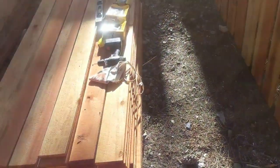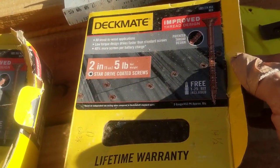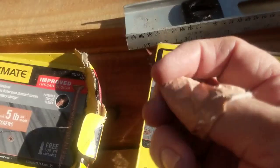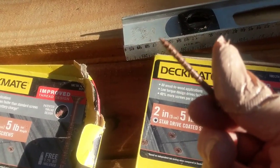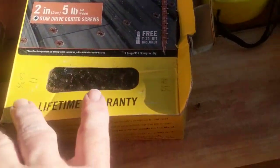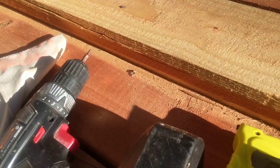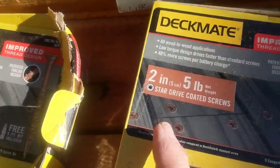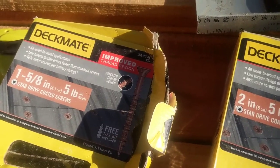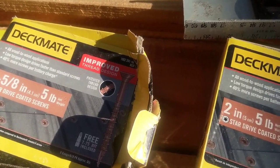So let's go into our screw choice. And I have them all here. You can use nails. I know a lot of people will say screws are slow. But these deckmates, you can see that they're curved and they have an aggressive thread. And that thread just goes so fast with the screw gun. And they also have a star tip. They come with a star T25 in there. It's kind of short. I like the longer ones. So I actually paid $2 to get a set of two long ones. I have inch and 5 eighths, 2 inch. And then I mentioned the 3 inch ones for the gate. The 2 inch and the inch and 5 eighths I use interchangeably. You do need the inch and 5 eighths when you set into the side of the 2x4 from your bracket, because a 2 inch would go through it.